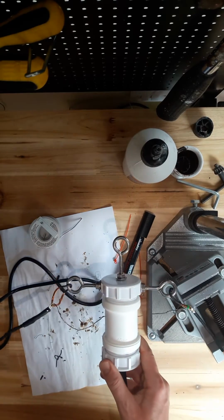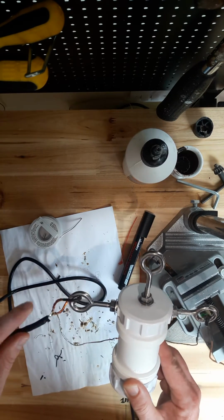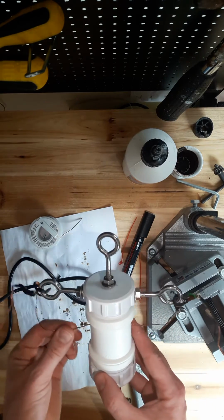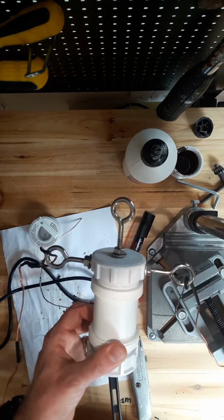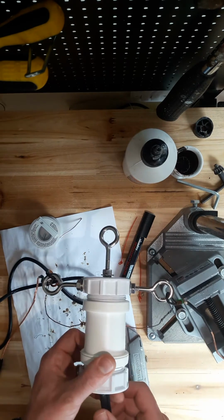So that's the feed point connector completed. As you can see, just a heat shrink tubing there just to cover over the joint, so I'll have to do that in a while. The wire from the open wire, the 300 ohm ribbon, and the radiating elements. Okay, so that's that done.